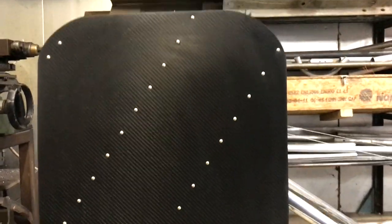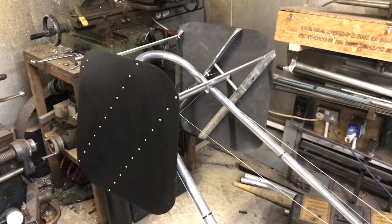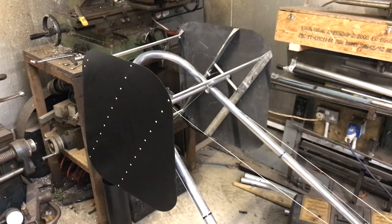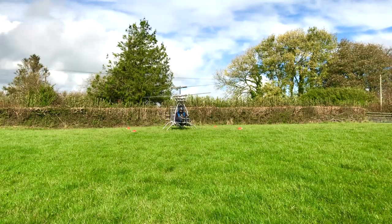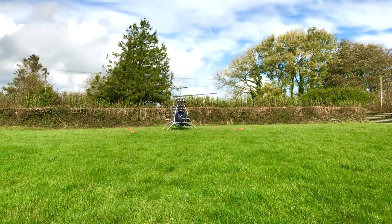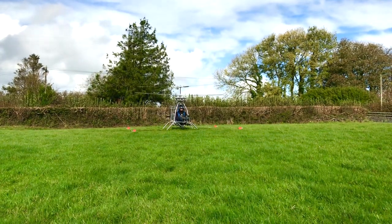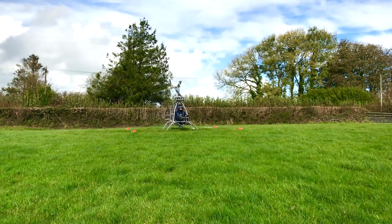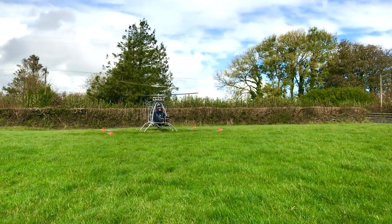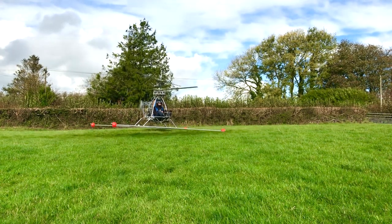The next thing I've done is remade the aluminium tail fins from carbon fibre, saving another two half-pound burgers in weight. There is another modification I want to do: change the drive gearing again. Flight engine RPM is 5460 and I think max power on this engine is around 6000, so I could be losing 5 to 10 horsepower by not running at 6000 RPM. I've been warned not to go above 6250 RPM or the con rods will let go, but I can easily make another primary drive pulley to change this.